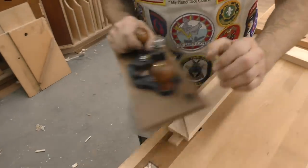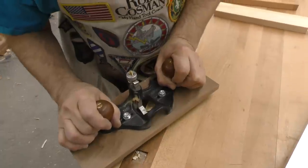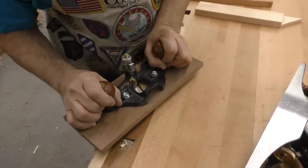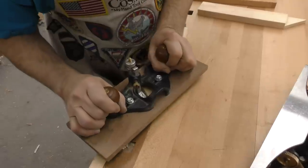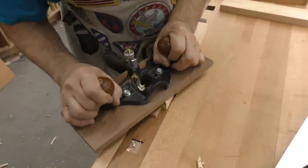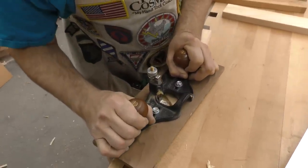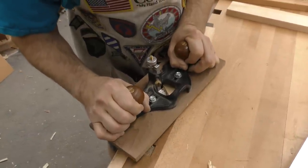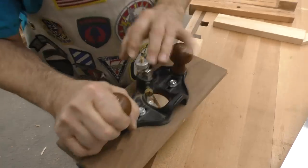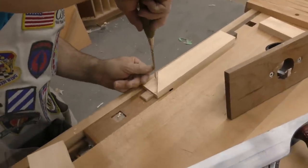So what I'm looking to do is to line the blade up with that marking gauge line we made. I always like to keep a little bit of tension on that locking screw so that when you adjust the blade there's no slip. Okay, that looks to be good right there — snug that up. There's a slot in there for a reason; sometimes helps to give that a little more locking. So when we're using this we don't want to break fibers off, so I'm going to shear it with the cutter facing in. If you come out the other way you may be lifting fibers, but if I go up that side like so — a little bit of inward pressure and a shearing cut.